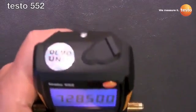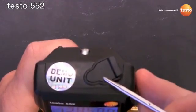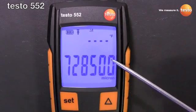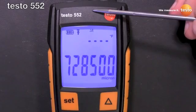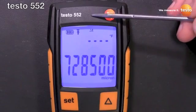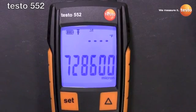Another cool feature is on top here there is a mini DIN plug that you can use with an accessory cable to hook this up to a 570, which effectively makes this a remote probe for the 570. What that allows you to do is pull a vacuum through your normal vacuum rig — half inch hoses, your own vacuum manifold — but still log it on the 570, so you don't have to pull a vacuum through the refrigerant manifold on the 570 to log it.